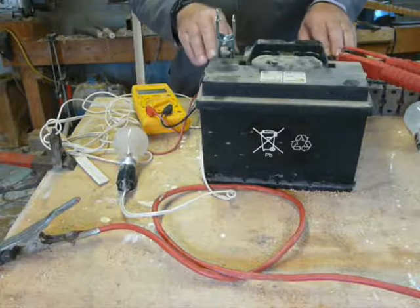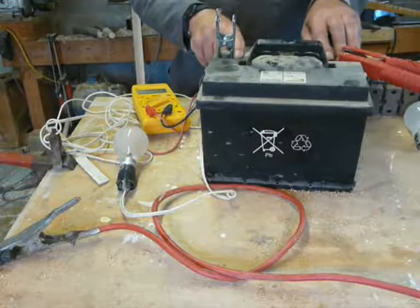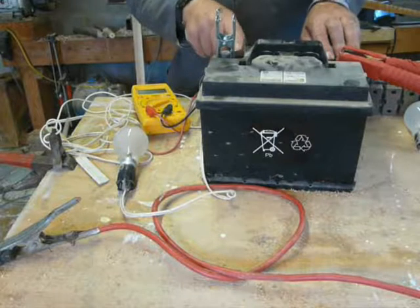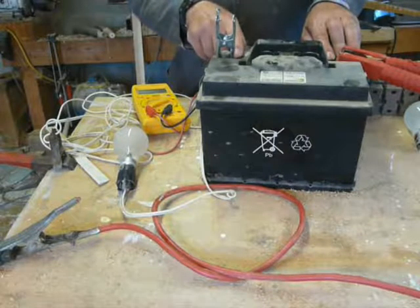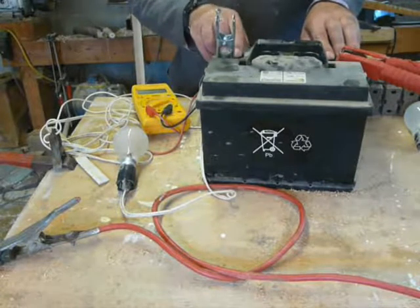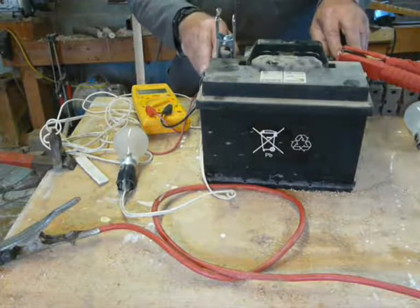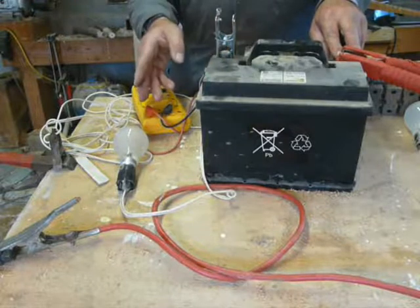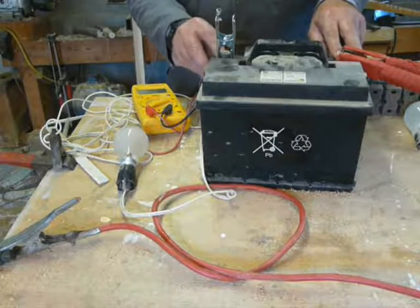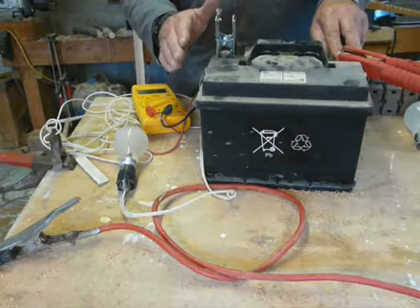Even if you bought really posh gear it would probably cost a tenner to build. This battery also runs the timers for the solar tracking and the motors. For instance, the motor will draw more current than a quarter of an amp, but it's only on for 20 seconds every half an hour. The battery buffers that, so you're not overcharging the battery trying to supply current to run the motors for short periods. The battery discharges a little then comes back up.